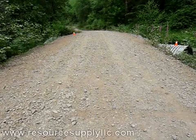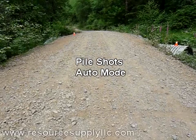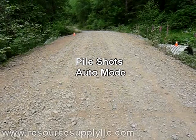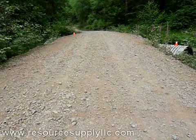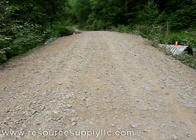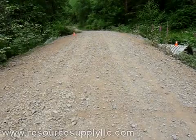What Joe's doing when he shoots the top of the roadbed here is taking what's called pile shots. He's got it in auto mode so that when he takes a shot, it just knows that the next one, every time he does it, is again a pile shot. It's just a matter of, as fast as you can, pushing the button on the TruPulse 360B and shooting a whole variety of piles at the top of the road surface here.